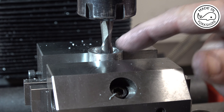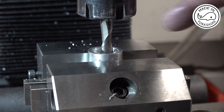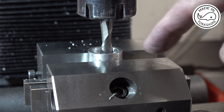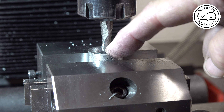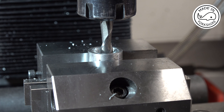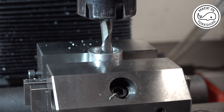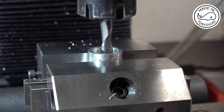This is a 3/8 inch slot drill, and the width of this groove needs to be 0.625 of an inch. I've already drilled a width of 0.375, so if I take 0.375 off 0.625 and divide by 2, I get 0.125. I've moved the y-axis by 0.125 and I'm going to drill to a depth of 0.438. Then I'll move the table by 0.125 twice and drill again to the same depth, plus a thou more each side. I'll do all that off camera.